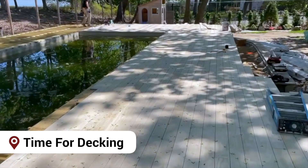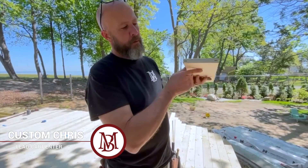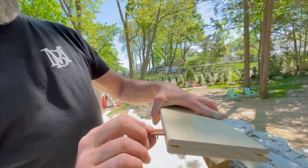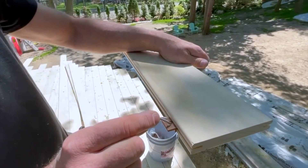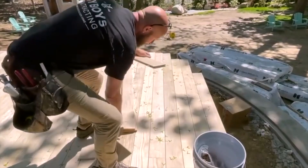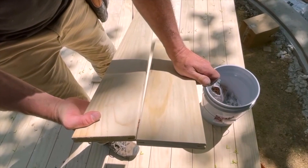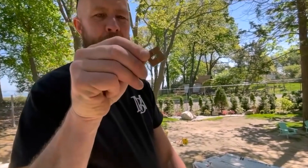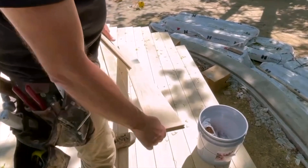Now let's turn to custom Chris and learn how the Sequoia deck is actually installed. You have a deck board that we have milled with a groove on both sides. This goes down. This is an Ipe clip — it has metal on the inside. This slips in here at the joist, and then you pre-drill on a 45 through the groove into the joist. You install this stainless trim head screw, so that locks it in place. Then the next board slides onto that, you put a clip on this side and you just keep going. The clip has a built-in spacer so everything stays the same. And then there's no surface screws, nails, anything like that to catch your feet on. It just looks a lot nicer — just a clean, smooth board on top.